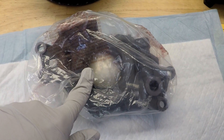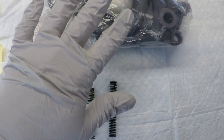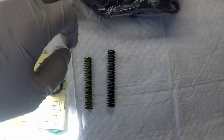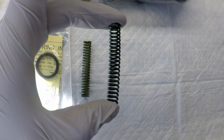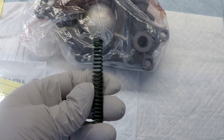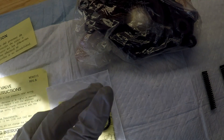It is assembled with an orange spring inside. If you're wanting 10% lower pressure compared to the orange spring, you would replace it with the yellow one. If you're wanting an increase of 10% over the installed one, you would use the green spring. We're going to leave it with the orange, which should give us about 70 psi. The green would take us to 80 — I don't think that's necessary for the RPM I'm running.